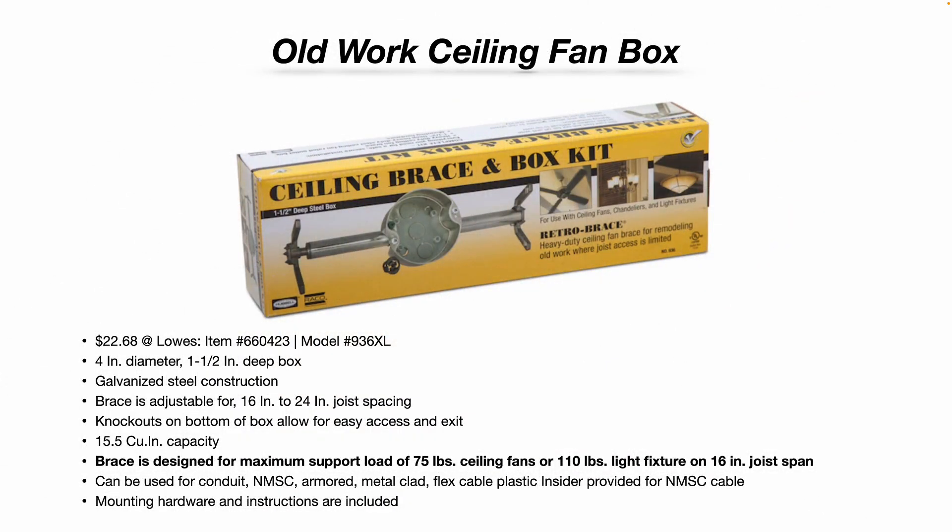Now, if you have an older home or existing building and you want to add a ceiling fan, and it's not possible to access the 2x4s in the ceiling easily — or you don't want to cut into the drywall, or there's no attic access — they make these old-work ceiling fan boxes. It's a retrofit kit, and you can see it has an adjustable threaded arm on one side. You essentially put this up into the ceiling, then unthread that left arm and tighten it against your 2x4 studs in the ceiling to secure it.